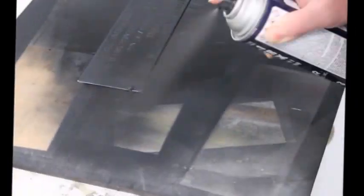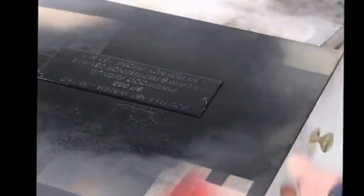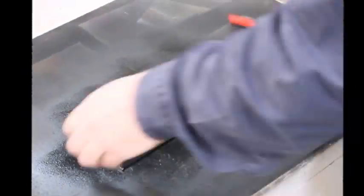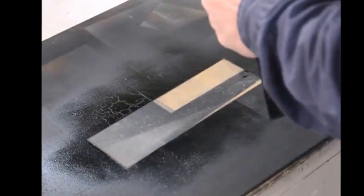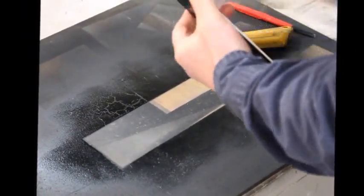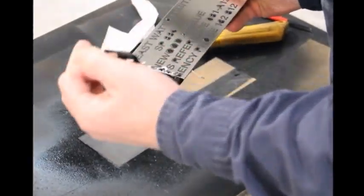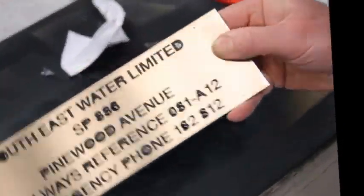The paint fill process consists of a few coats of acrylic primer and then a few coats of enamel gloss black paint. Turning the job during the application of the paint ensures an even coverage throughout the etching. After giving the paint a few hours to dry, I can then remove the resist and get a look at the final job.